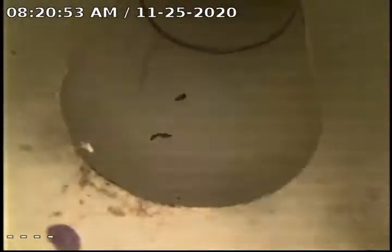Today is Wednesday, November 25th, 2020. We're at Simons Elementary in Milan. We're going to be doing a televised inspection through a 3-inch floor clean-out that was installed. We've installed a 3x48 stent to cover a section of broken pipe. Today we're going to be descaling 3- and 4-inch cast iron. We will probably be back on Friday to do descaling as well, and also to do some flushing with the jetter.